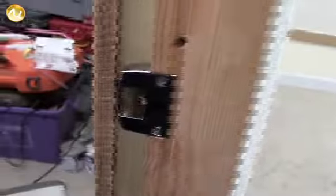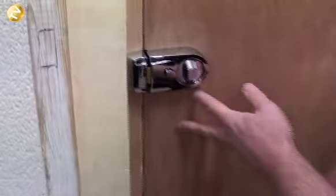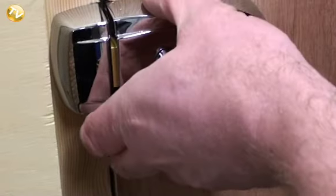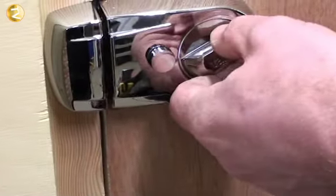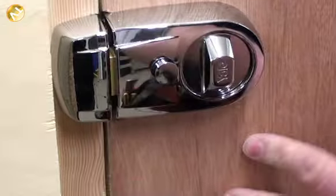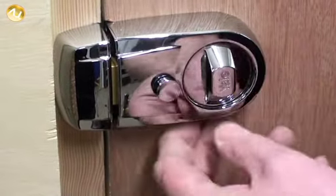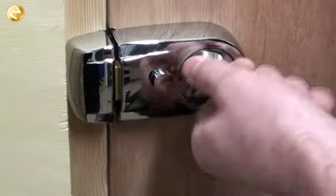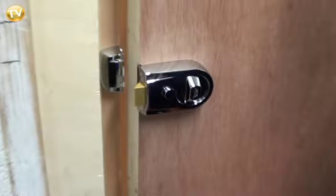Now that's right home. Just test the lock to make sure it shuts properly. You can see that shuts perfectly — there's no movement in the door whatsoever. Undo it, try it again, push the lock down, make sure it's night-safe, which means it's double locked. Push the latch up again. And that's it — job done.